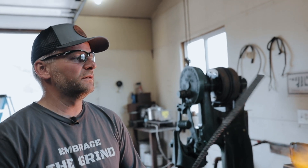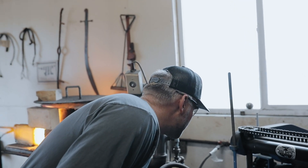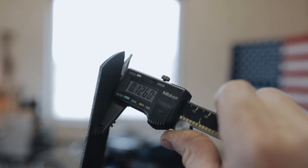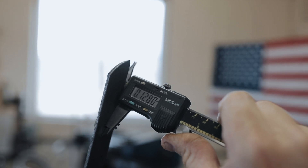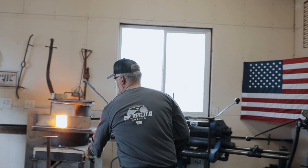We've just come out of this forge here — looks like it's pretty straight, nice and clean. My rolling mill says I am 128 thousandths thick on that dial indicator. That's pretty impressive. It took me about three or four heats, and I went from that little block of steel to a folder blade at 128 thousandths. I'll take seven or eight thousandths off both sides — maybe ten — and I'll be down to a hundred thousandths thick folder blade: clean, perfect steel.